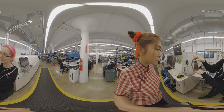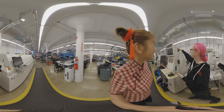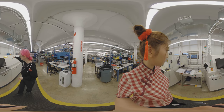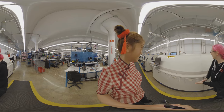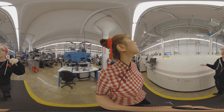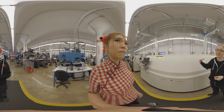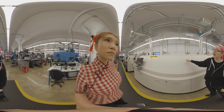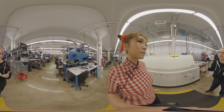We were given this inspection system as a gift from one of our vendors, which is awesome. And then it's on to the oven — after it passes inspection the board goes into the reflow oven, which slowly heats the board until the solder paste melts. This oven is nice because it came in two pieces. We're on the top floor and didn't want to break a window — usually you'd need a crane and to shut down the street — but this oven maker cut it in half for us. They sell it in two pieces, which not many companies will do.